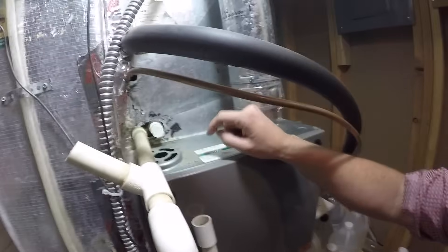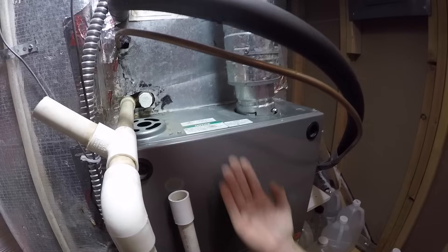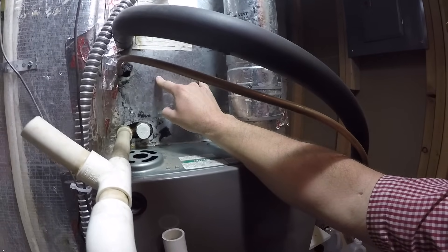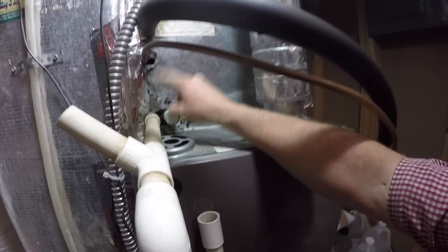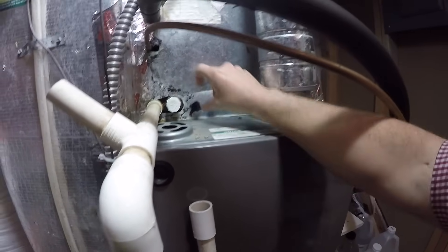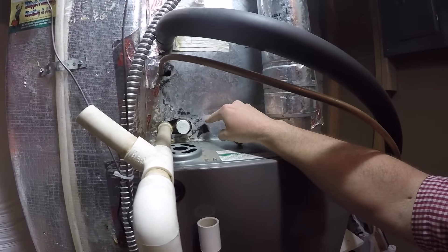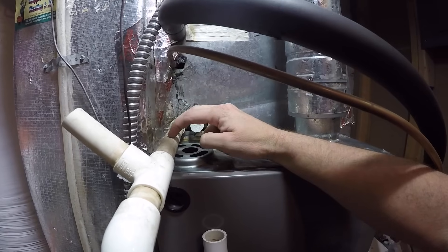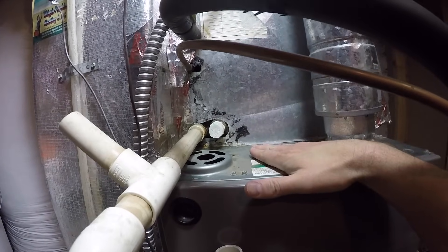Here's what happens in air conditioner units. Inside above the furnace, the furnace blows the air up through from the furnace up through the duct. And inside of here is your coil. You can tell that because here's your air conditioner lines — these go out to your condenser on the outside of the house. But underneath that coil is a tray, about an inch and a half or two inches deep. It's sealed all the way and it's there to capture the water. So when you create cold air, it sucks the water out of the air. That water drains down into that tray. This is your drain for that, and it's not a high pressure line. You should be able to find a place where it's not glued. They glued it all the places that are above the furnace because they don't want water getting in the furnace — that's the whole idea.